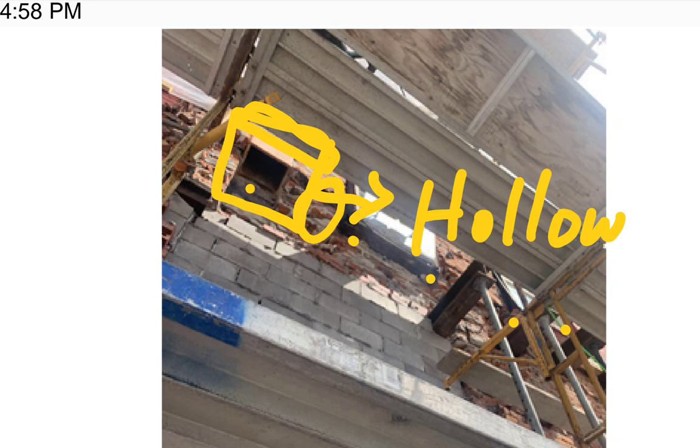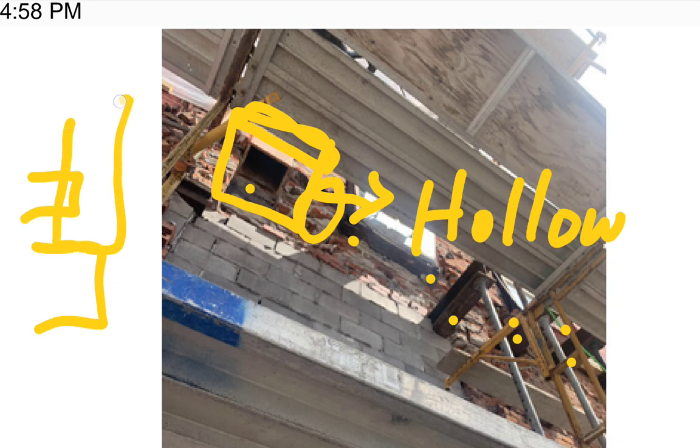Let's think of the loading now, the steel loading from the structure. Well, it's not here. It could be, we don't see the steel. Remember I talked about does the steel stick out? Well, in this entire image and the other image, I don't see the steel sticking out from that wall. Remember the one engineer said he believes, per the library's images, that he has about a 2-inch position of steel over top of the load-bearing wall.